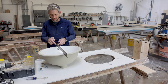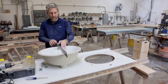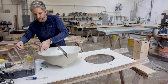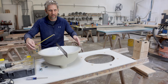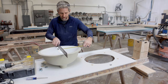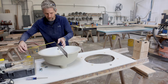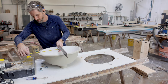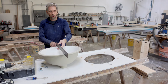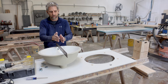I also want this to be lined up with the overflow hole right here. Now once I think I'm pretty much in the center of the sink, I'm going to take my tape measure and measure to the outside edge. You can just pick a spot — it just has to be the same on both sides. So this is eight and five eighths, and that's eight and three quarters. You don't want this thing swinging back and forth because you want to look right down the center of this and you want the drain and this hole to be in the center of this.